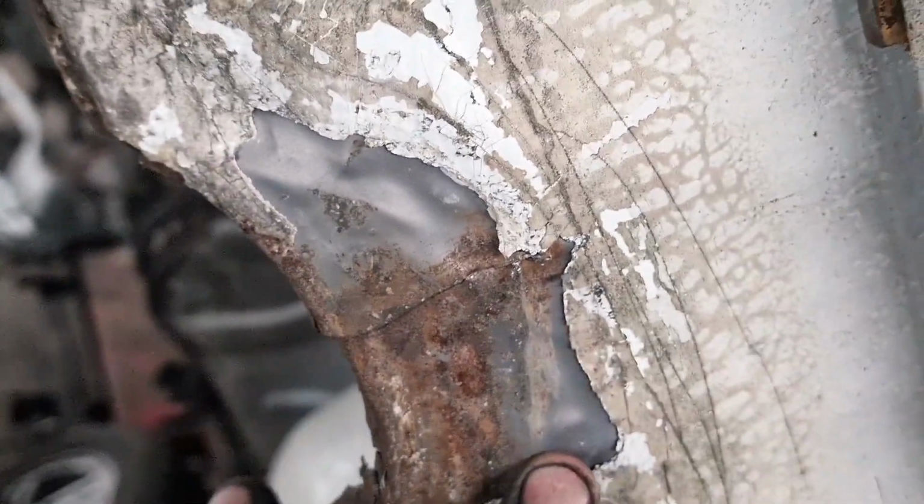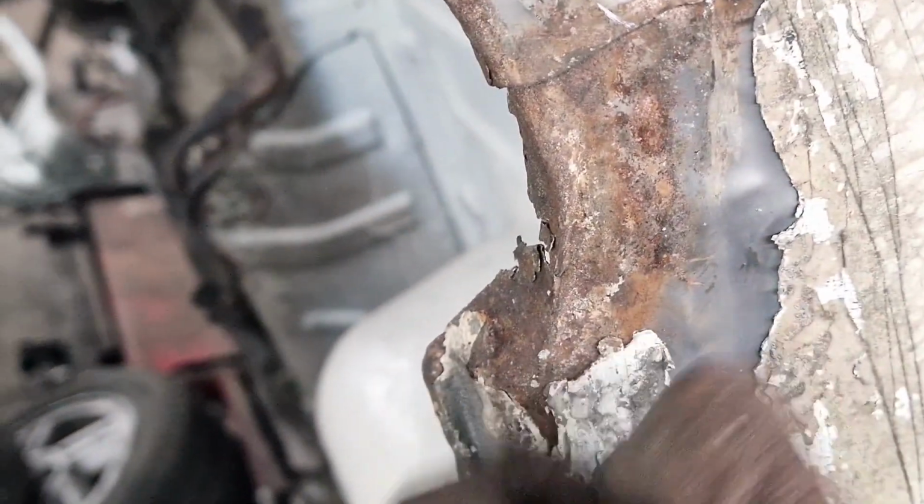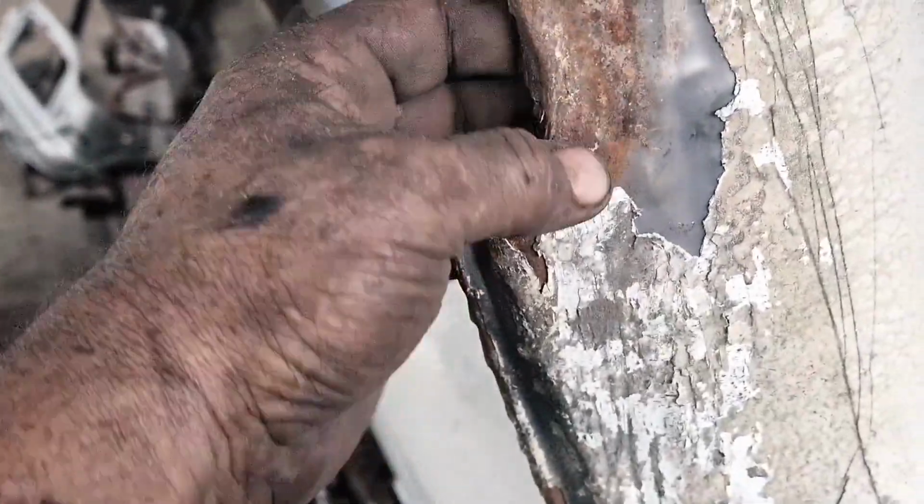We've got a bit of a buckle there, if you can see. We'll get that straightened out. As you can see, the panel's really clean under there. So what we'll do, we'll grind all that back, weld that section in, make it all nice, get the bend in for the exhaust, get the exhaust on, put a little bit round the back here.